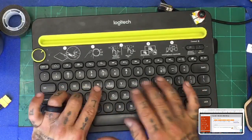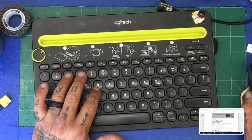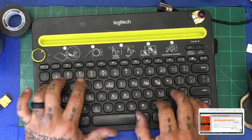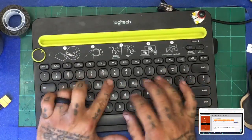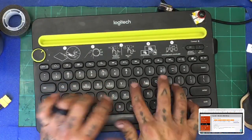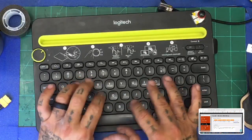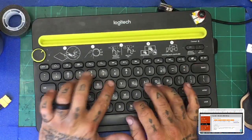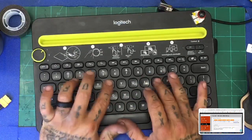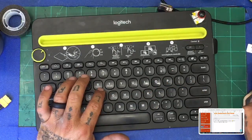I know it's capital. I think it's like this. I don't know. That doesn't look right either. What is it? Is it SBUS with a capital? Oh, it's all caps. Okay, fine. SBUS connection instructions. And it'll say make sure that you use UART3 for your SBUS connection and then configure it in the configuration tab to have SBUS as the protocol for your receiver. Yeah, that's it. Okay, so there's a note there, and at least you can see it that way.